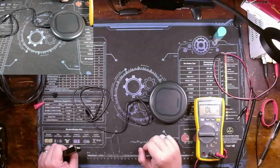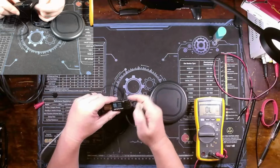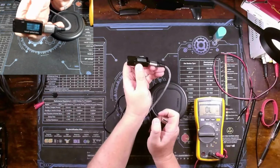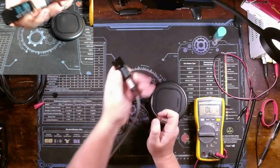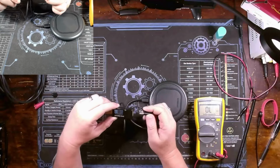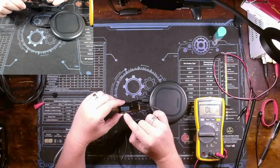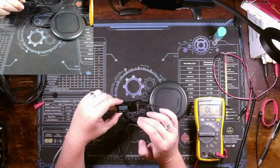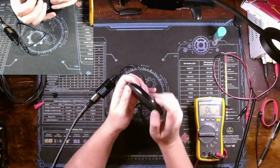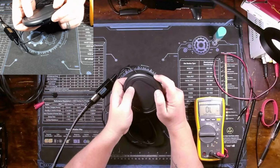And so really that's what I'm going to do in this video, just take it step by step and see if we can figure out what's going on. So we got our resistance measurements there. I've got a little USB tester right here, as you can see right up there in the video. That's probably backwards for you though. We're seeing 5 volts, a 5 volt supply, and I plug it in. Are we drawing any amperage from our main supply? It dropped down to 4.97 volts and 0.06 amps. So it's bouncing between 0.06 and 0.08 amps, so 60 milliamps, 80 milliamps. That's not a whole lot of amperage considering we're supposedly charging this as a battery bank, also producing wireless charging. And then, of course, still no LEDs.